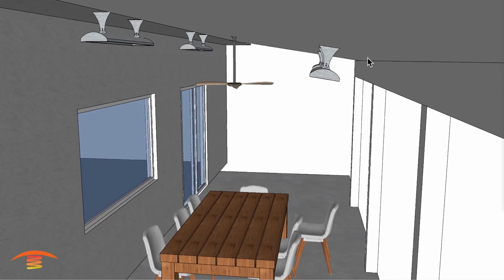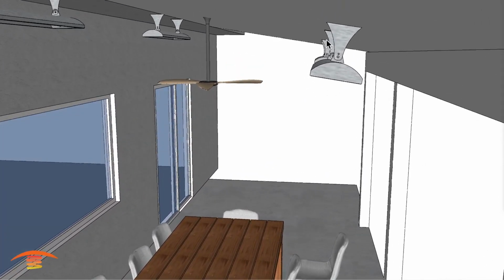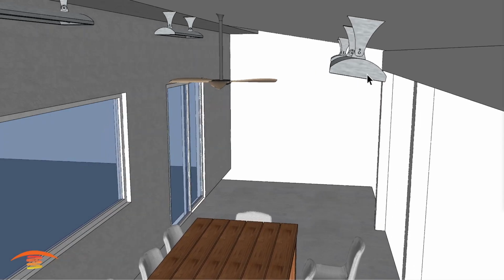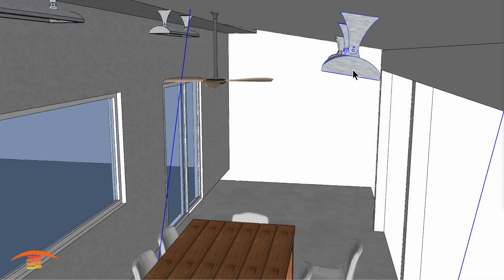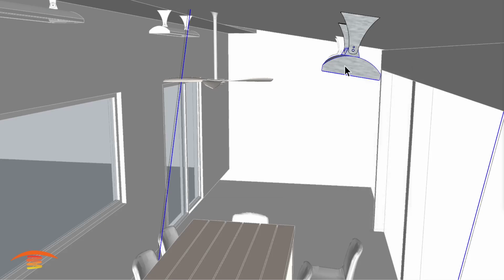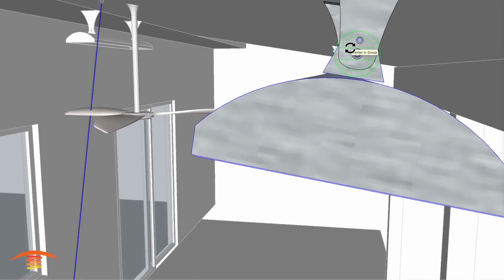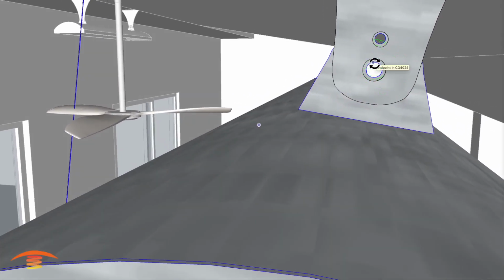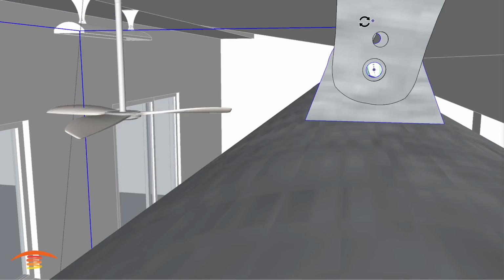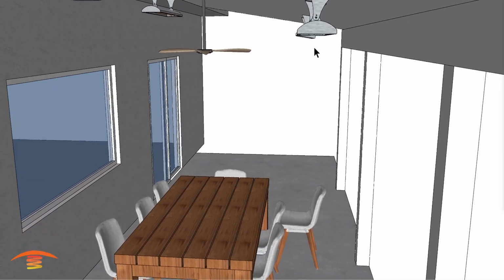I'm copying the angle of the ceiling itself. However, I'm just showing you how the bracket here actually would fit, but you would have to change the angle of the heater itself so that it's meeting the proper clearances, which is, let's go ahead and get that done here just as an example. And let's see if I can grab that. Sorry about the delay here. There we go. And we'll go down. It's approximately 9 degrees there. So that would be the true angle of the heater, roughly.